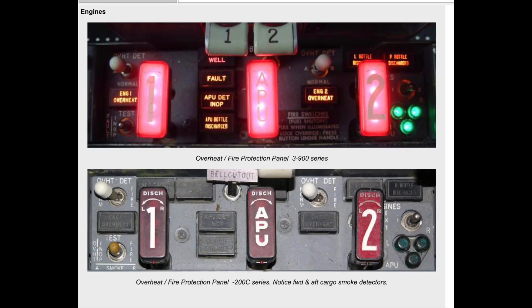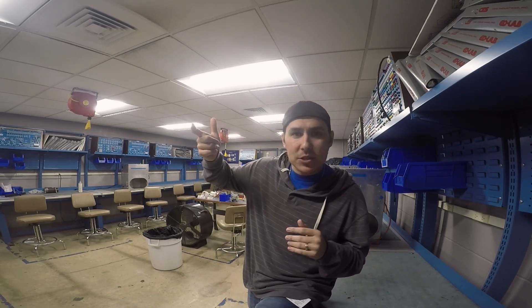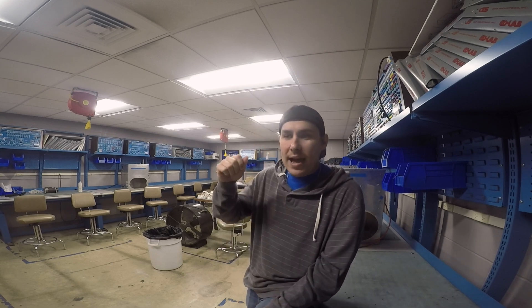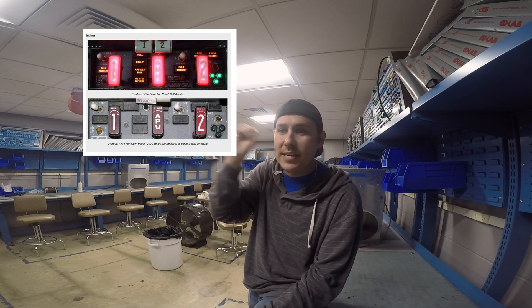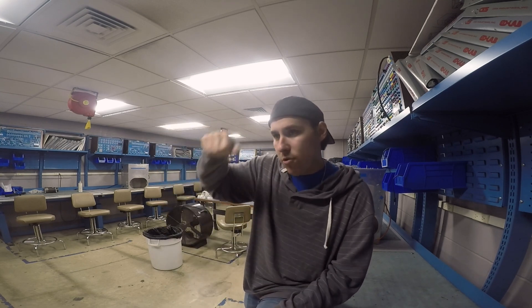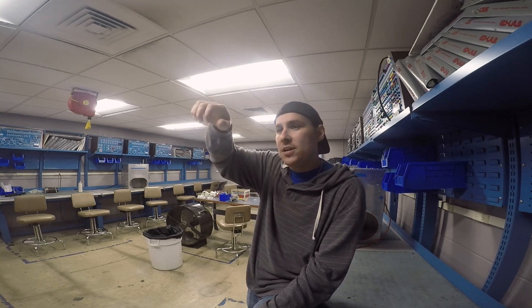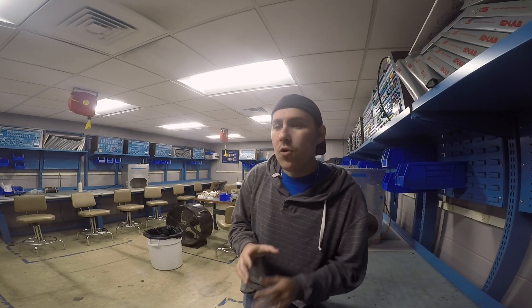In order to pull a fire suppression system, you actually have to take a couple of steps. Depending on the aircraft, the installation, and the design, they are double-guarded — meaning you cannot just reach up and flip a switch to discharge the fire agent. In some cases, you have to lift a safety guard, then pull the handle out, and then twist it to get the agent to disperse. They do this because pulling a handle alone is not enough; you have to make a second movement — turning it 90 degrees — to get the agent to release.